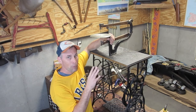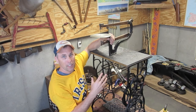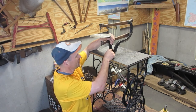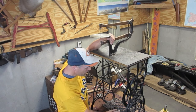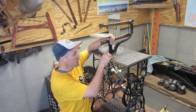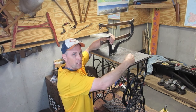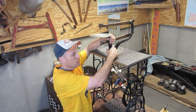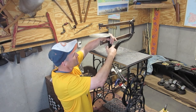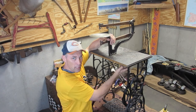I would have gladly paid more than $40 for this assembly because I just love the challenge of fitting all this together and making it work. The real challenge for this project was figuring out how to get the power from the foot pedal to the assembly. I originally was going to come through the top with the leather belts, but because this bar is on this side of the bracket it would have got really complicated. So I decided to go underneath.